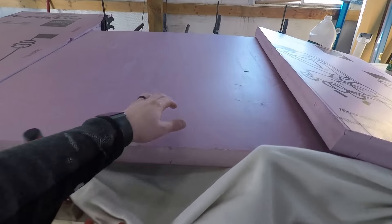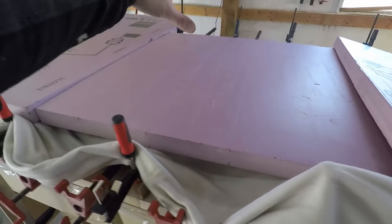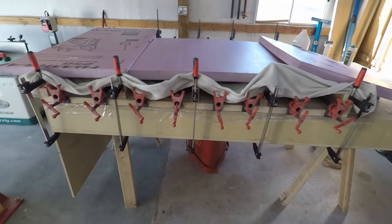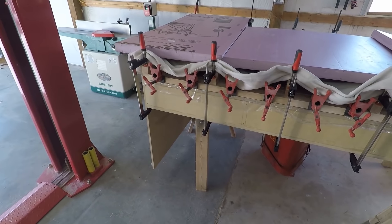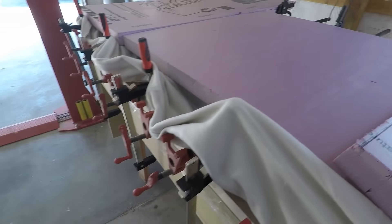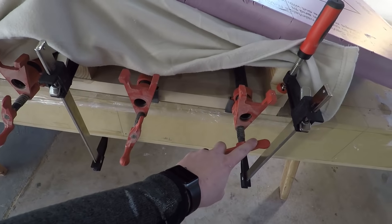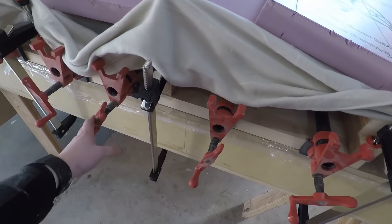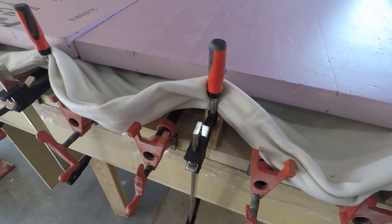It's glued up — it took 20 minutes. I should have glued it up in two halves and then glued those together, but I was kind of committed so I just went ahead and did it. It should be fine — at least I hope it's fine. I'm going to let this dry for about 24 hours, then I'll undo these clamps first, because if you undo the others these clamps will want to bow it still. So loosen these up first and then take those boards off that are holding it straight.